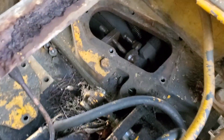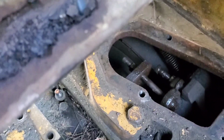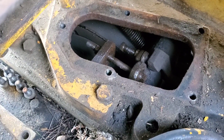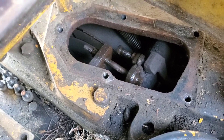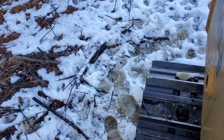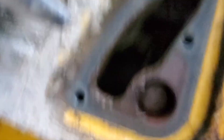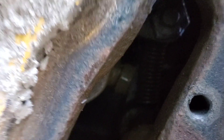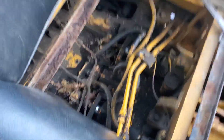I took all the cases off — as you can see, that's what it looks like in there. This one's only wet because I threw some Liquid Wrench in there, because the brake bell crank actuator bolt doesn't like life. This is what the cage looks like. That nut right there in the middle — that's what adjusts the brake band, and we'll be getting to that pretty shortly.